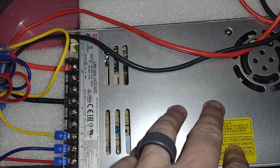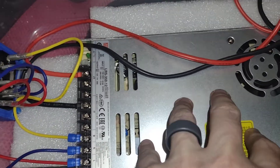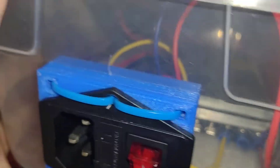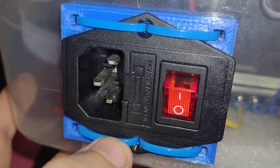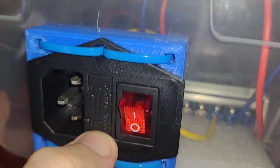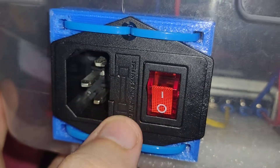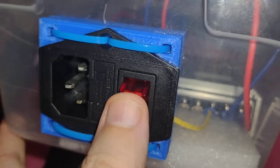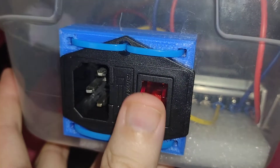These run roughly about $35 on Amazon — I checked the other day and they're still about the same price. That gets you the main power supply, but you still need your connections. For $8 I got a two-pack of these plugs, and I already had a cord — any cord of properly rated gauge will work. Right in the center there's a fuse; I pulled it out and checked it — it's a glass fuse, hard to read, I couldn't tell if it was 15 or 20 amp, I think it's 15. And there's a nice little switch that takes a little bit of force to flick, which is good so it won't accidentally switch on or off.